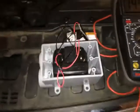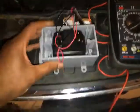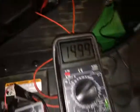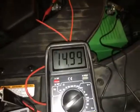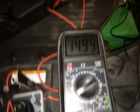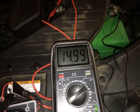So I can expect that if I had this in my car parked, I could just take this little box, connect my alligator clips to the terminals, and it will keep my ultra capacitors at least at battery voltage. And that 5.2 milliamps is close to nothing.